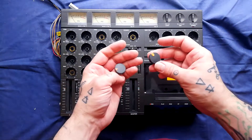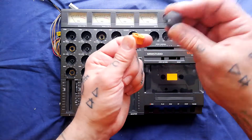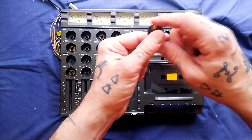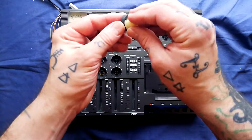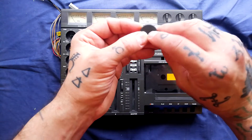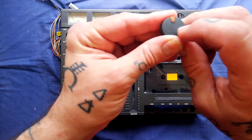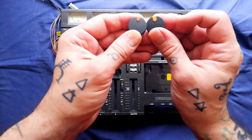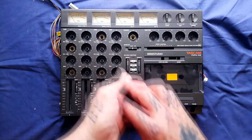The first variation to remark upon is the way the knobs are built. On the one I've been deconstructing here, these knobs consist of a coloured plastic core and then there's a rubber cap that goes over the top, so that coloured marker you see is actually a bit of protruding coloured plastic. The other variation is that every single knob is a clear plastic base with a rubber cap over the top, and the coloured part is a printed overlay onto the rubber. These don't last as well — you can see it's a bit worn and the colours aren't vibrant. I don't know which variation came first; probably the latter is a cost saving measure.